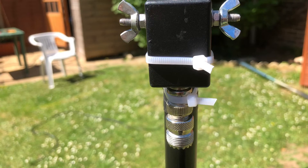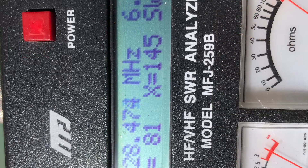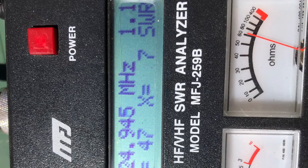Here we can see the micro balun strapped in readiness to the pole to be hoisted up. As we can see, 17 metres is a bit on the long side. Turning our attention to 10 metres — that's the shorter wire — the SWR is about six and a half, so we've got a bit of pruning to do. The next bit will confirm we are very much too long. Let's see where it's actually resonant — and well, here we go — resonant on 12 metres.